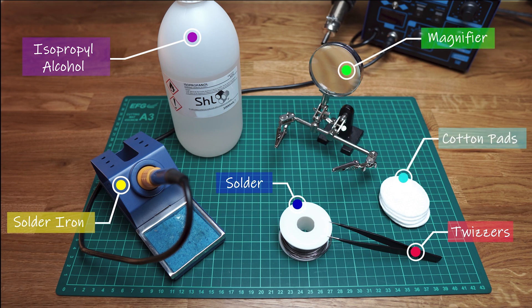The magnifier, cotton pads and the alcohol are only optional. Isopropyl alcohol would be used to clean the Nixie tubes from accidental fingerprints. Touching them directly will cause the glass to get oily. These oils, which are barely perceivable to the eye, will enable the tube glass to heat unevenly due to its incandescent nature. This might result in cracks or premature burnouts. The cleaning step is optional, as on this instance the operating temperature never exceeds 40 degrees.